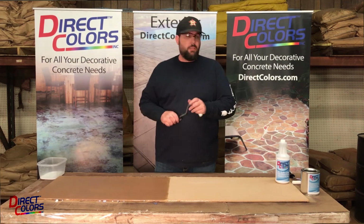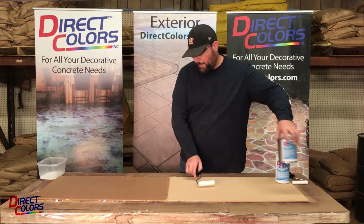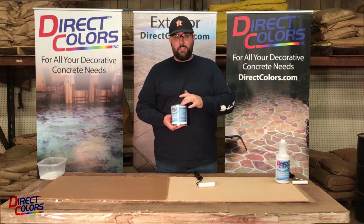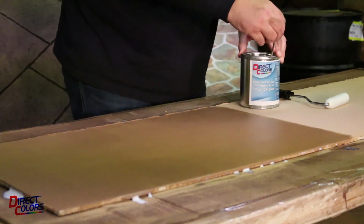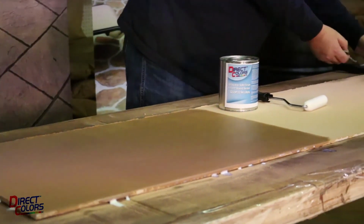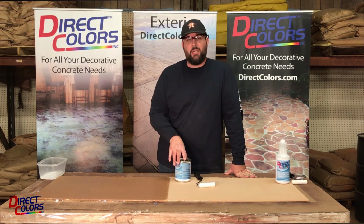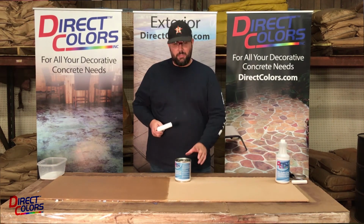I've got another roller here that we're going to use, also defuzzed and ready to use with the solvent-based sealer. Again, this is the sprayable satin sealer, solvent-based. I'm going to go ahead and pop the lid off. Here you would want a solvent-resistant core, as we mentioned, so it doesn't damage and release fuzz into your finish. And here you would want to use a metal paint tray. You don't want to put this into a plastic paint tray. It will eat the plastic, melt through, and give you a big mess. Okay, I don't have the metal paint tray, so I'm just going to dip my roller into this material.